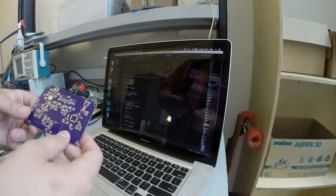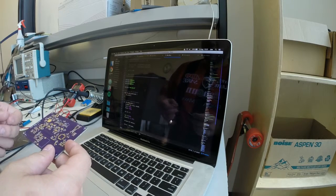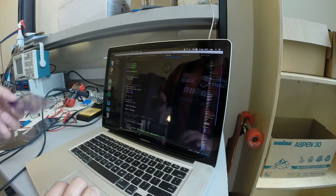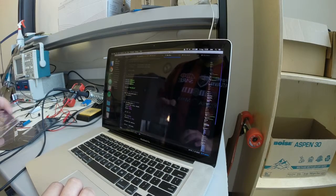Part of the board that sends data to the phone includes a microcontroller to actually read the sensors and send it through UART and ultimately through USB to the phone. And so we've written substantial code for that microcontroller. And that code is hosted on our GitHub repository. It's all open source code.